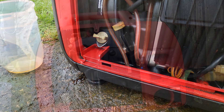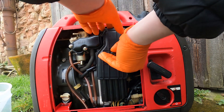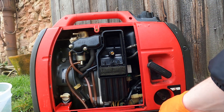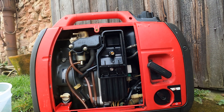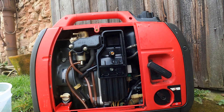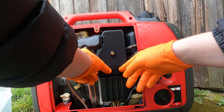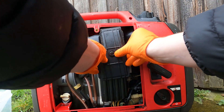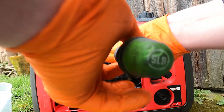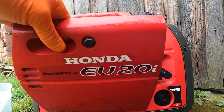Now we'll move on to the next step, which is the air filter. For the air filter, it's this housing here. We have one screw, the same as the front cover — undo the screw. Here we can see both air filters: we've got a top one which is a fine one, and a lower one which is a lot coarser. Remove them, give a quick wipe. Here we have two new Honda air filters which we'll push back in. The lower coarser one just slots in there. Like disassembly, the assembly is straightforward. Place the cover over and screw back into position. With this part of the engine now serviced, we can close the side cover.